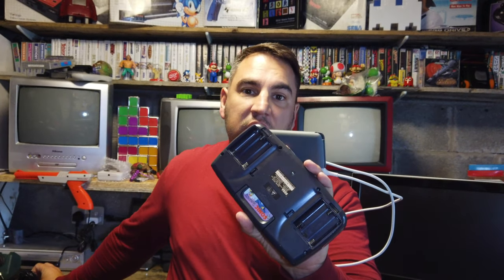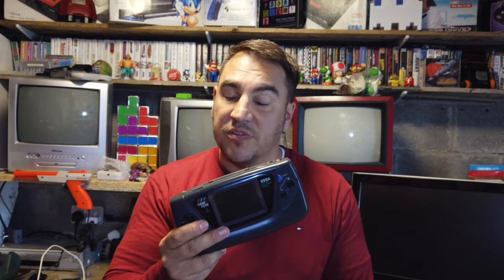No need for the huge Sega power supply brick either - not a bad piece of kit but you don't want to carry that everywhere. This is pretty universal and can be used anywhere out and about. It's been a busy couple of hours getting the caps sorted and getting the USB-C installed in the bottom, which was actually pretty straightforward. If I were to do it again I'd get a Dremel for a neater fit, but the finish isn't too bad for a hack job with a drill and a glue gun. The capacitors are fiddly but worth it. I don't think I've seen anyone power the Game Gear off a five-volt power bank before - please comment, like, and subscribe!